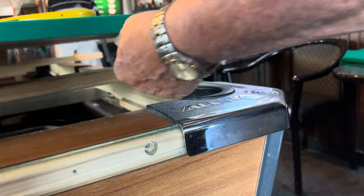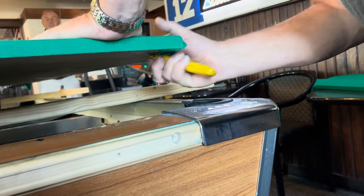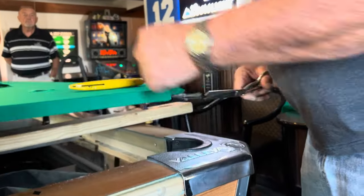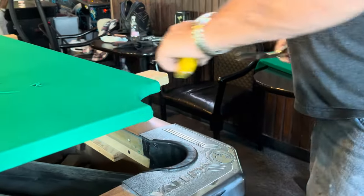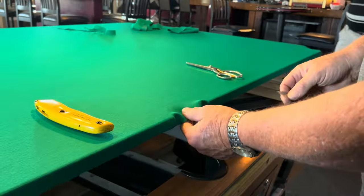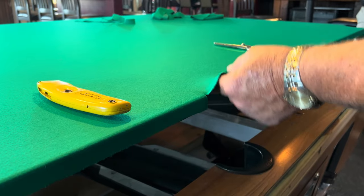This finger, like this. Rub it, bond it. Then cut your extra tail off. That's a pocket. I hate to look at them tails. There. They trip up a lot of people because the side pockets always end up bubbling out on everybody. You cut that slack away like that.